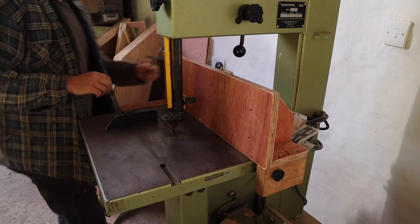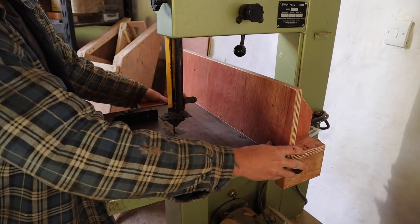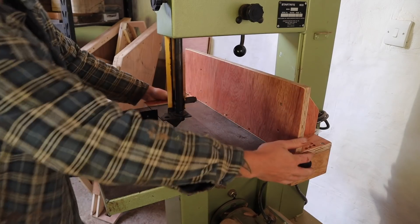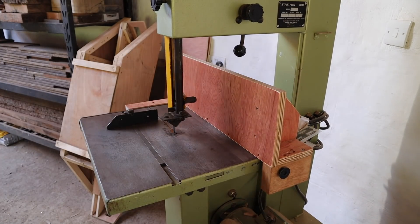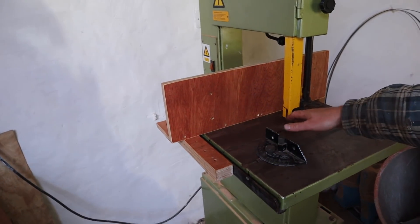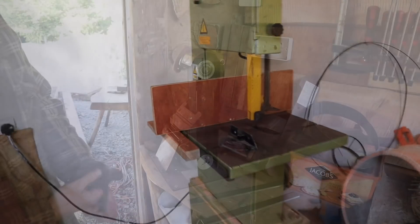While I was waiting for my friend yesterday, I made this fence for the bandsaw. Quite cool - just plywood, can slide back and forward. Got a locking nut on the back, all supported and square. That's going to be a big help because I'm going to use it for speeding up the process of cutting tenons - part of the preparations for the greenhouse build.